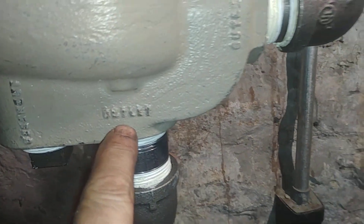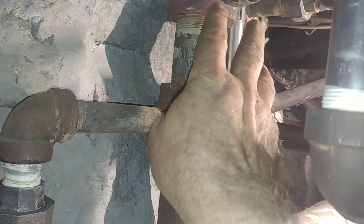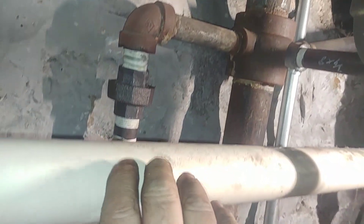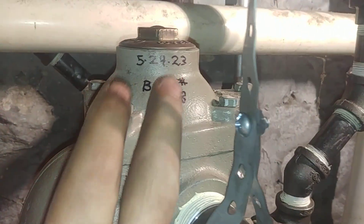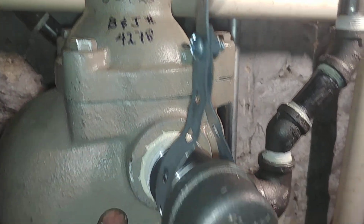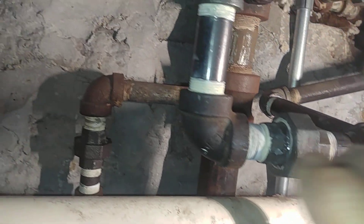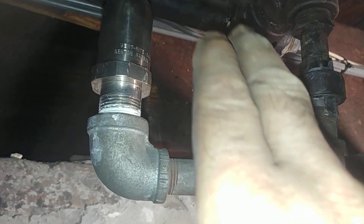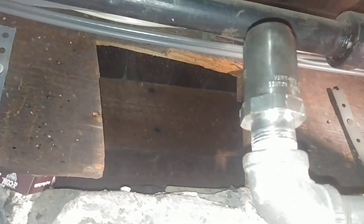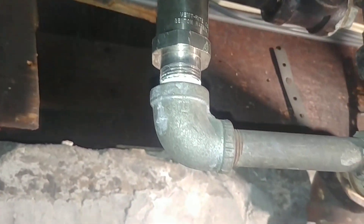Steam, water, and air arrive. The water trickles through. The air is expelled through the thermostatic element and comes out here, then is sent to a small vent and on to the dry return, which goes to the boiler - there's a trap return, which is where the vent point is for this.